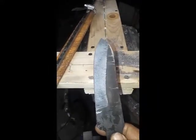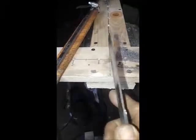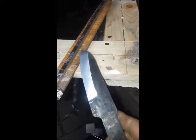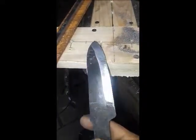After another 20 minutes of file work on the other side, I realized that my ricasso line on this side and this side is a little bit off, plus the angle of my edge bevel is off — I've got more bevel here than I do here. I think it's because I changed my file: I went from a mill file with a smoother cut to another file with a double cut, and this file's a little bit thicker. That's okay though — I still got some beef to go, so I'm going to come back to this side, fix that bevel difference, and fix that ricasso area.